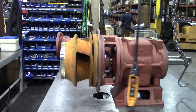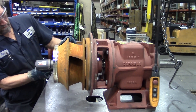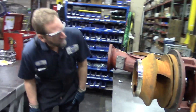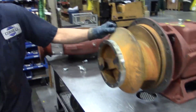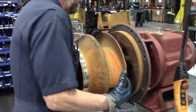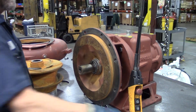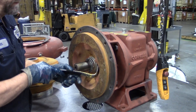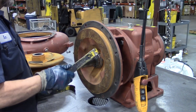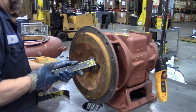The first tip: watch your fingers for the cutters — they're pretty sharp. The next thing is to make sure your seals are clean when they go back in. As you're removing the impeller, you'll see you use two pry bars to pry it off. Sometimes that won't get it off, so you can use a puller if you can get one wide enough to pull the impeller off.